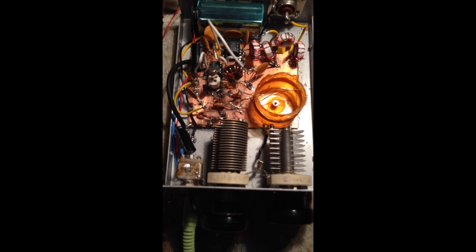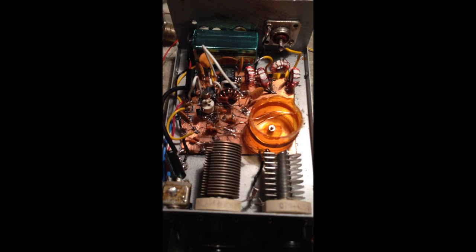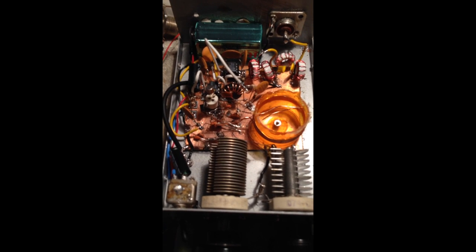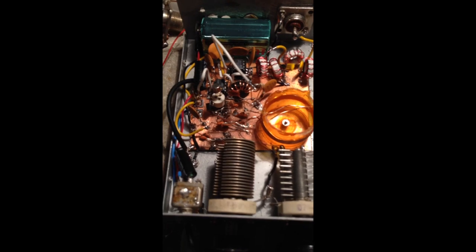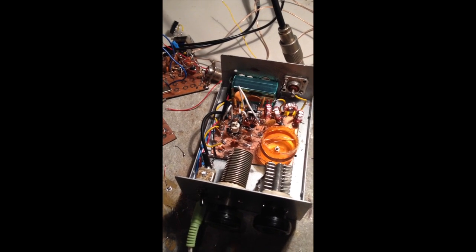It's really small, but it really helps to tune in the sideband signals and I really wanted that feature. I'm running all this off a 9-volt battery, and I've got a Zener diode back in here — everything's running off 6 volts off the Zener. I thought maybe the Zener would give me a little more stability with the VFO. Right next to the box here I've got my original schematic from the EMRFD. That book was really instrumental in helping me kick off these exploits with building my own circuits and radios.